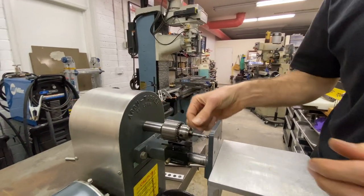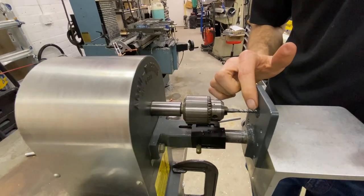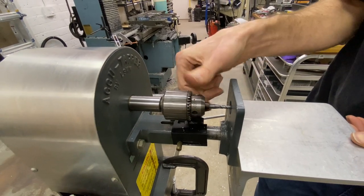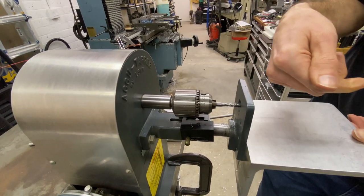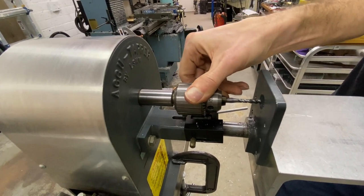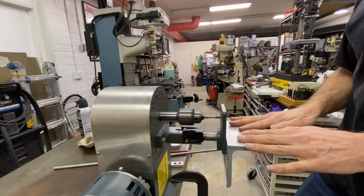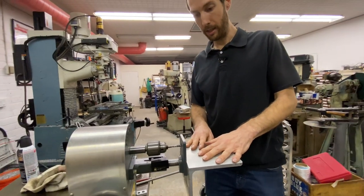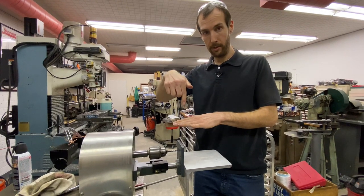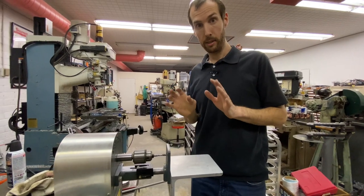It's a regular Jacob's Chuck that you can put really whatever you want into it — it's mostly meant for taps. The table slides, and as you put pressure on the spindle it turns clockwise to run the tap into the part, then as you pull away from the tap the clutch reverses and unthreads it from the hole. The tapping action is all done by hand and by feel. We also have a couple of the older vertical style machines for very small taps that self-reverse and come out very fast, which is easy even for small parts.